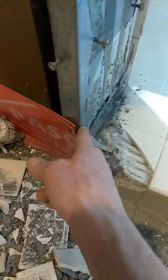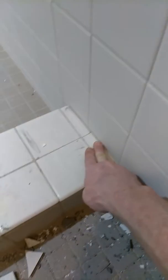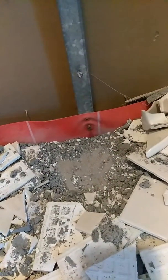This is another mistake they always make in every video I see — they're cutting the liner right here at the curb and leaving it exposed like that. This shower was leaking right here. You can't do that. Your liner on both sides of your curb needs to extend out at least to the outside of your curb. They're cutting the liner right here with nothing flashing up — you need protection back there.